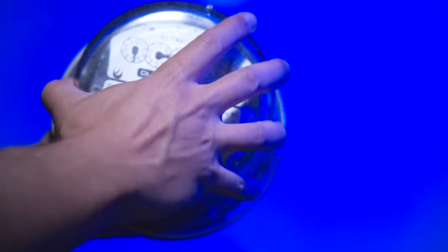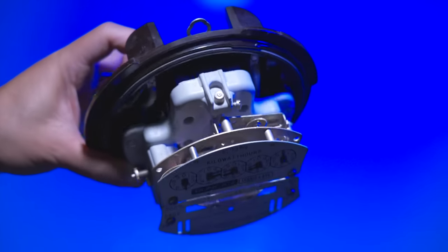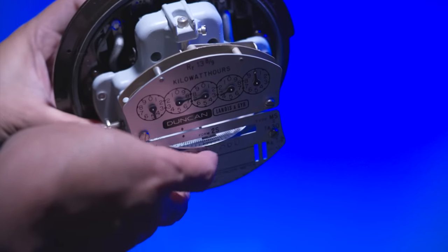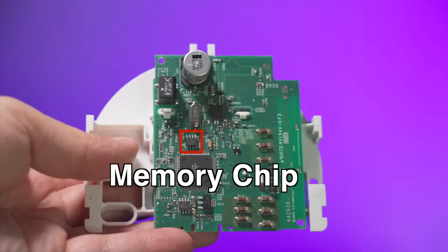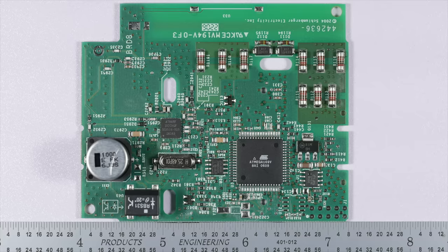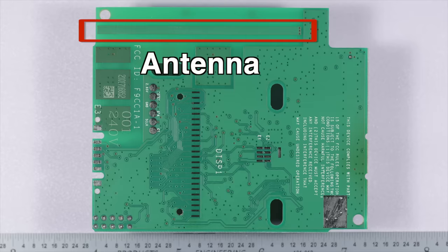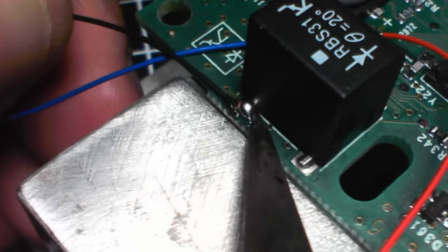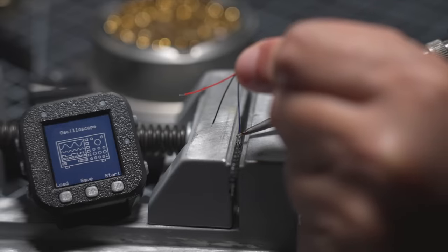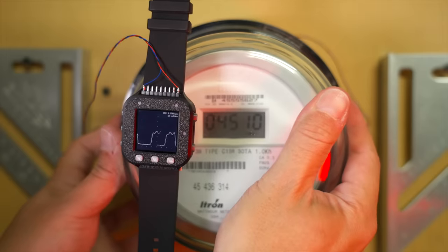With old mechanical meters, if you managed to find a way around that security tag, you could remove the meter, take it apart, and the power company would never know — there's no logic inside, it's all mechanical components. Smart meters are different though. Inside, they have ways of recording the events that took place during their removal. Since most transmit data wirelessly back to the power company, they can report when they lose power immediately. If no one around you lost power, then it's clear something happened to that individual meter. They also have a vibration sensor which detects any shaking — if it detects shaking with a power loss, it can save that data internally as a tamper event and send it back wirelessly at the same time to alert the power company that something fishy might have happened.